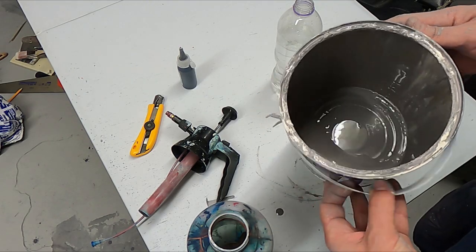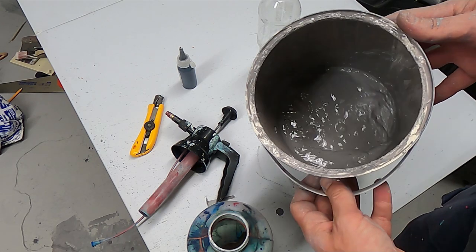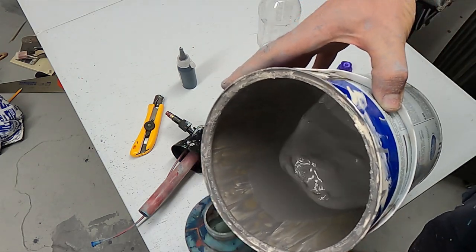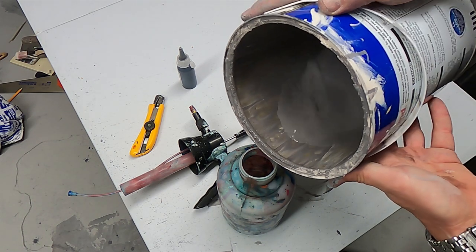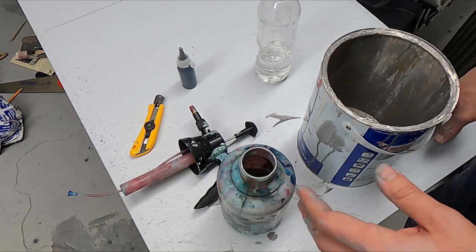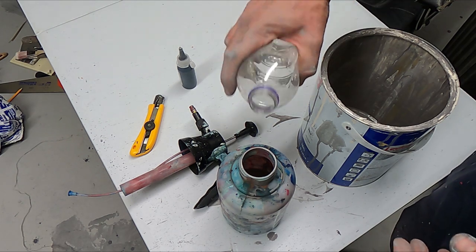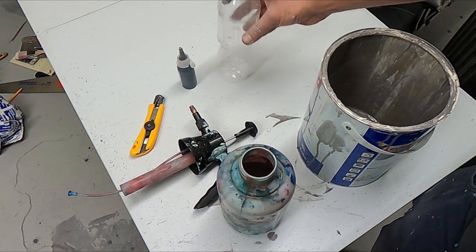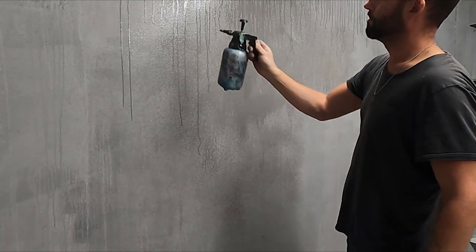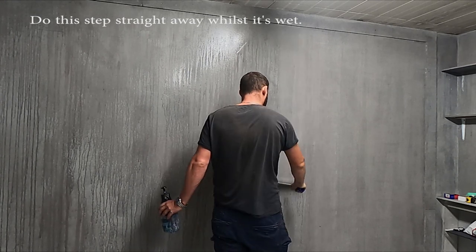Okay, so now I'm going to use the dark color I had and I'm going to put even more water in it. The idea is that you can barely see it and it adds a bit of interest without being so noticeable, because when the water dries, most of it is gone. Altogether, it's probably a ratio of 3 to 5% paint and the rest is water. So it's a lot of water on this. So the roller is wet, but it doesn't have any paint on it.